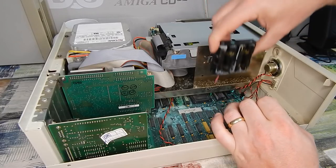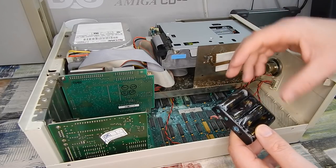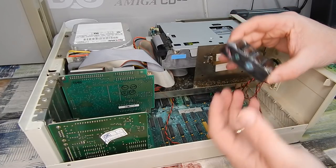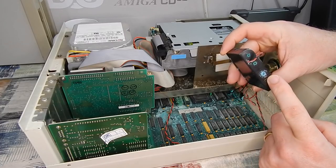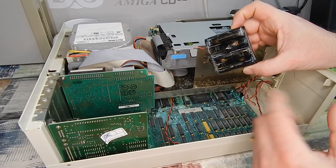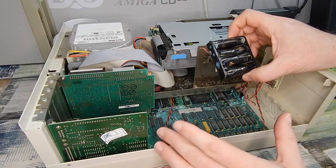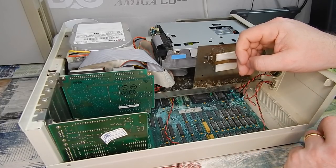The offending battery pack used to live in here. I did try to pull these wires off the header on the motherboard, but those have welded themselves on there with the corrosion, so I just wound up cutting the wire - not that we could ever reuse this anyway. The most annoying thing about this is that these are just AAs, and it would have been really easy to remove them. In some ways you can almost forgive the Varta battery damage on motherboards - those batteries are generally soldered to the board and the majority of people won't have the tools to desolder them.